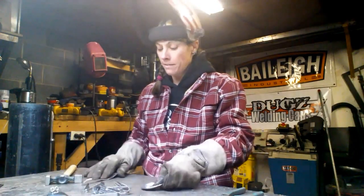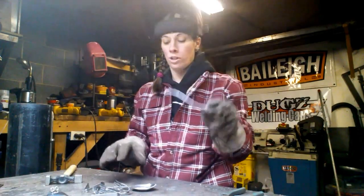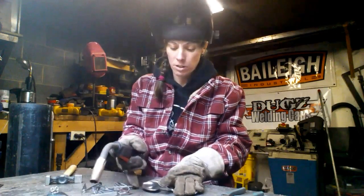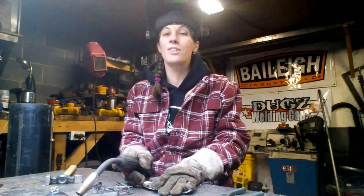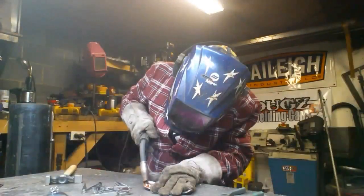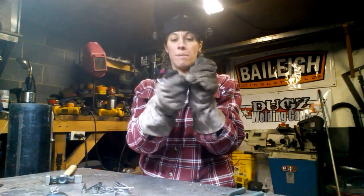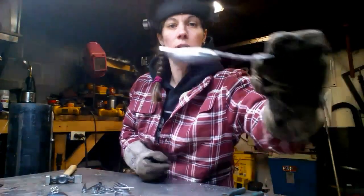To do the bottom of his head, you're going to take the other spoon — the other half of the spoon — and you're going to weld your tongue in. I weld it towards the back. Just hold it down and give it a couple of tacks. I like to have it off to the side a little bit, so it's not coming straight out of the mouth — it comes off to the side. You can do yours however you want. When I first weld it in there it's flat, then I take it and bend it up just a little bit so the mouth can be open.